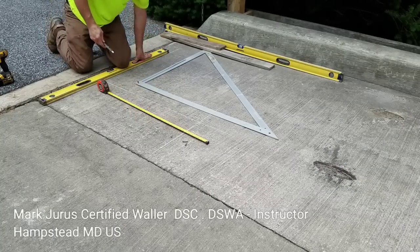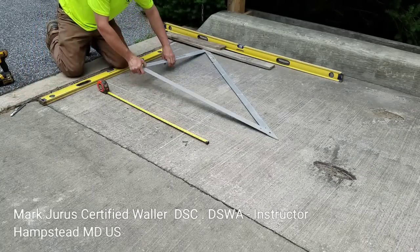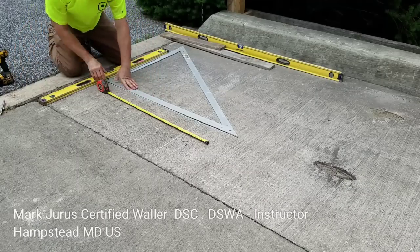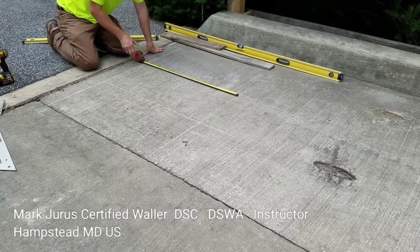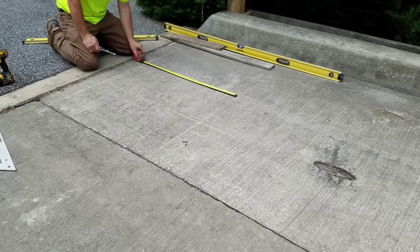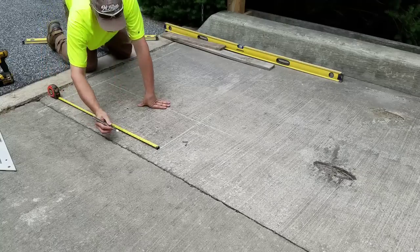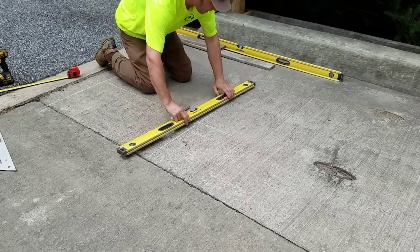The first step — basically I'm just going to do a grid to have some guidelines. Just do my baseline first. Next, bring my square in and do a vertical line. From there, I'm building a three-foot frame here, so I'm going to measure up 36 inches. Mark that there, come over here, same thing — mark over here. Do another straight line as your guide.